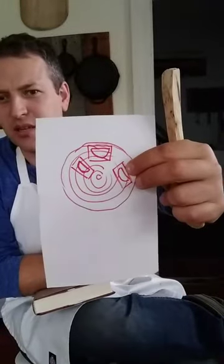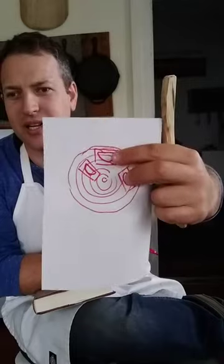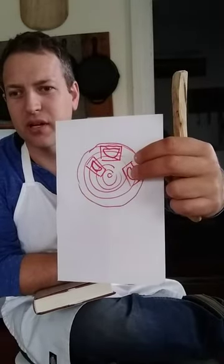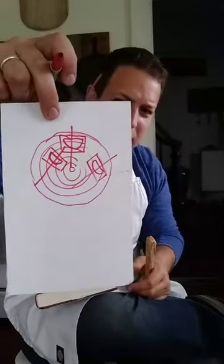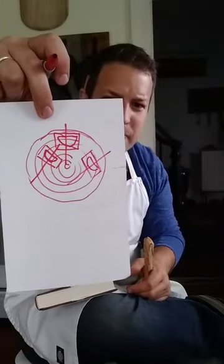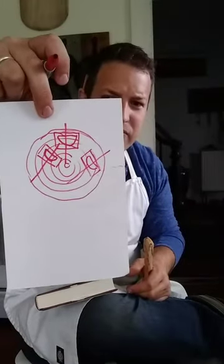That one is in between. You see how it's not quite lined up like that one to be perpendicular, but it's also not quite tilted like the radial. It's halfway in between, right? If this one's center line is there and there, this one's center line is kind of skewed like that. They're called rift cuts. Okay, cool. Why is it called a rift cut, Tom?